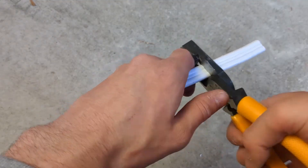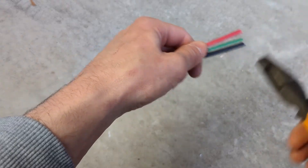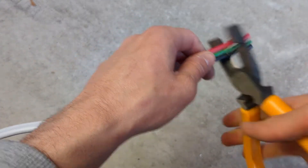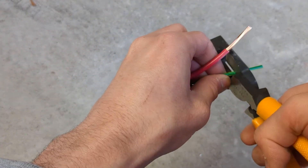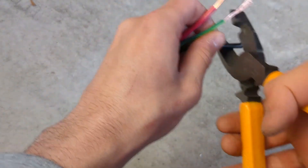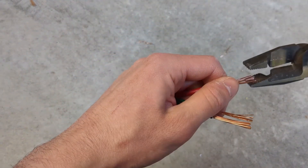As you can see, this technique works on 4mm TPS. It is a bit harder to do the inner insulation in one swift motion. What I've done is just marked where I'm going to strip the insulation and then go one by one — active, earth, neutral — and then I twist it afterwards.